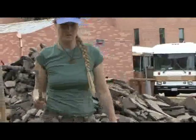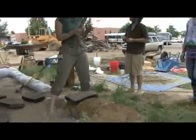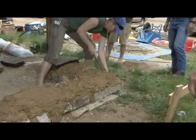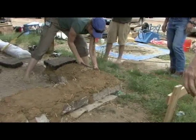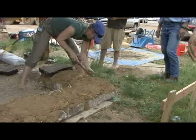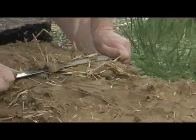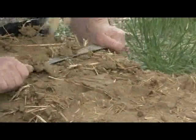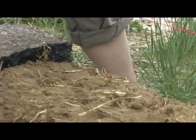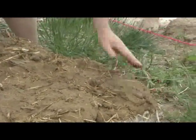A machete turns out to be a really good cob tool. If you're building a wall and you do get some slump after a bit, while it's still wet, you can come back and just carve it down. You can take this and if you really wanted to work it, you can start to carve it flat. We could use a two-foot level to find level on this. Working out the outer edge and the high spots is really a good thing.